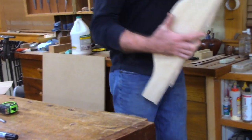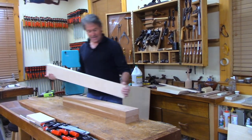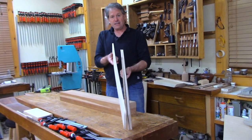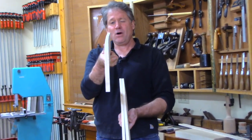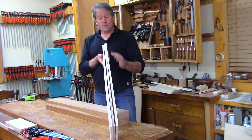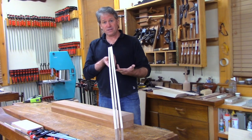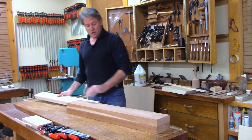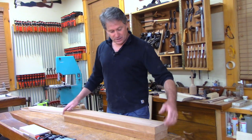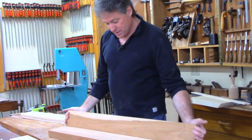Here's a great method for gluing this up - we'll make our own plywood right now. See how funky and curved these layers are? They've got a bow in them. The fence I showed you is dead straight, and it started very similar to this. The way I did it is by using true cauls that you clamp the layers between. If you have some heavy material that's really flat and true on the faces - they barely slide around, it's almost suction - those are going to be the interior of the caul.